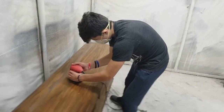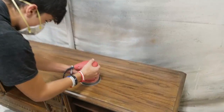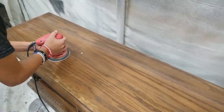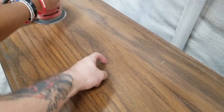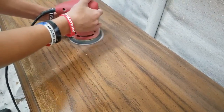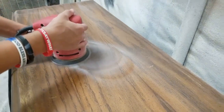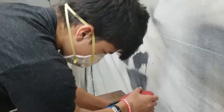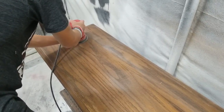While I was working on this project, my son was in town and he decided that he wanted to help me prep this project a little bit. I managed to not record any of the prep other than my son sending this piece here, but if y'all watch my videos in the past, you know I'm a stickler for prep. I wipe everything down with trisodium phosphate, make sure that I get all the dirt and grime off of there, and then come back with either 120 or 220 grit sandpaper and make sure that everything's sanded twice so that the paint has something to adhere to.